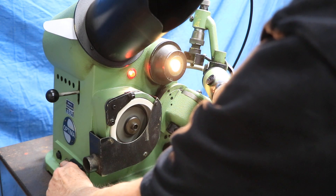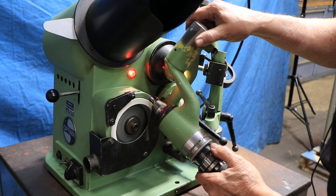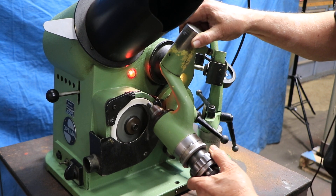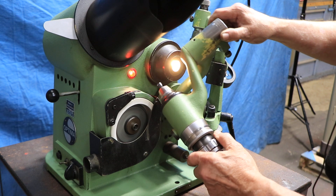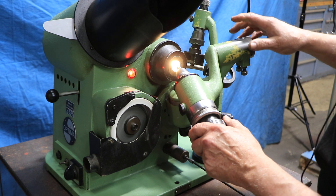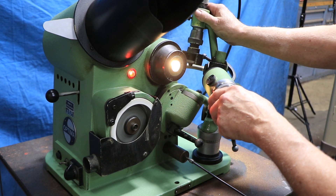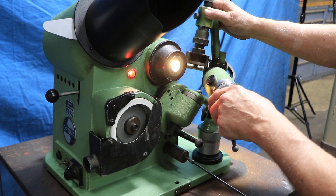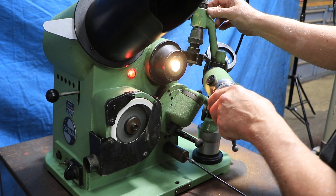Let's turn it on. Over here we would pretend to grind our wheel and do our drill with this little radius thing. You know what you try to do when you do these by hand on your bench grinder — try to get that back rake, or whatever you want to call it. Well, this does it for you, and you look in the screen and figure out what you just did, see how everything is coming together. When you bring it over here, it activates this little baby grinding wheel and you thin the web or split the point. They even have a little magnifying glass you can swing over and look at it.